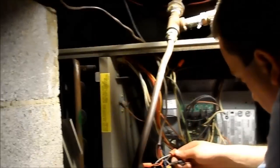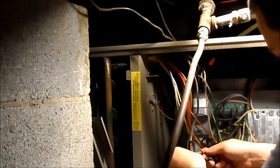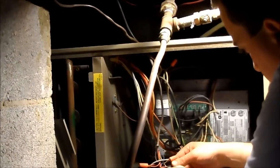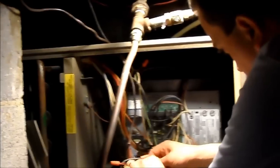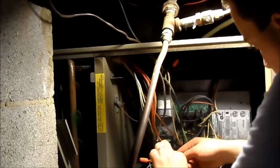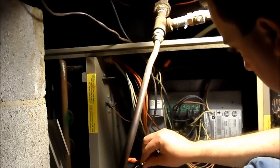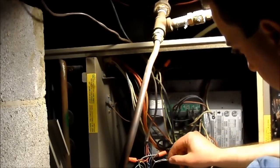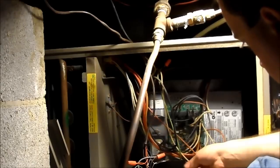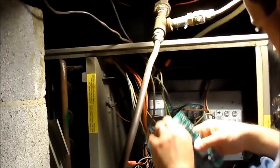Over here — and that's just beautiful right there, isn't it? Taped up, no wire nuts, just taped up. That's poor wiring right there. We'll find another wire nut when we finish putting things back together so that can be done right. The red wire connects to two white wires. So: green to green, white goes to red and yellow, and the red goes to the two whites. Now we'll start disconnecting wires one by one from the old board and connecting them to the new board.